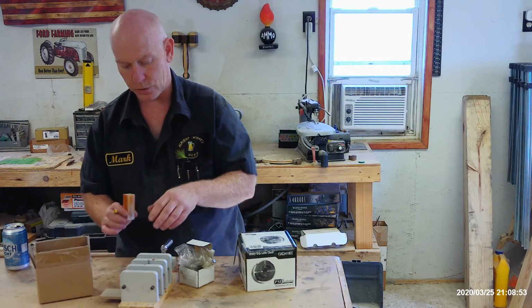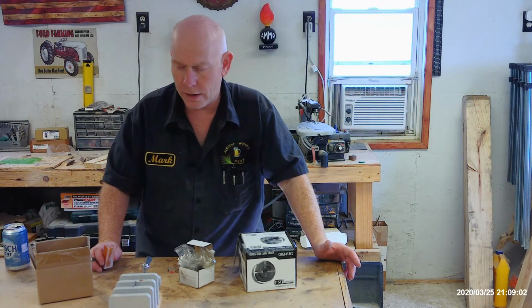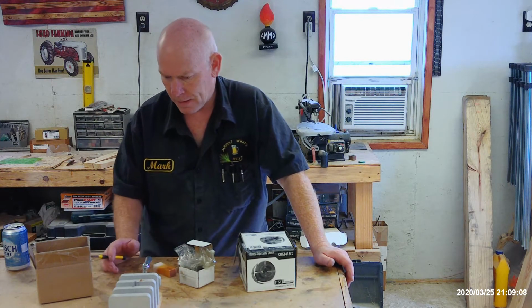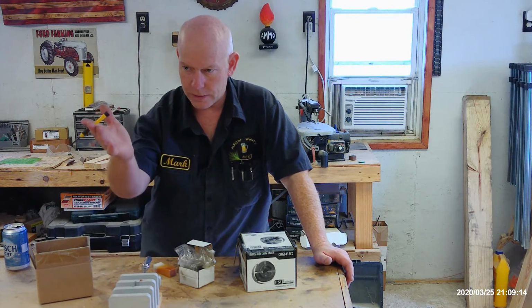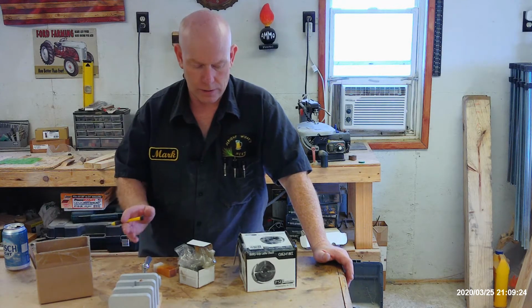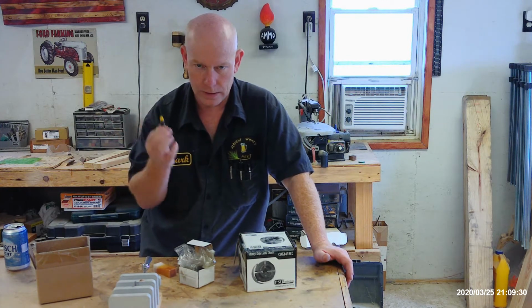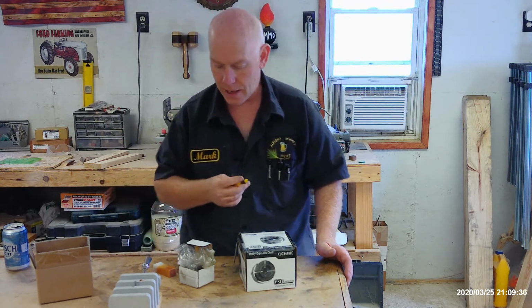And what I've heard is drilling them in a lathe eliminates a lot of that bit wander. I don't know why. I don't even know if it's true, because I read it on the internet. I'm not entirely certain why it would make any difference, because you've got your blank locked in here. Your drill press chuck isn't going to be any different than the chuck in your lathe, and as long as you make sure it's measured and true, and you go slow with it, it shouldn't matter whether you're drilling it in a lathe or on the drill press. Now in the lathe, your drill bit is stationary, and the blank is the thing that's turning. So I don't know, maybe that's the key factor.